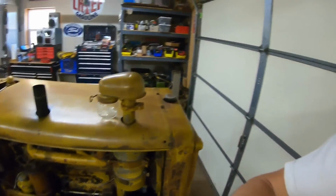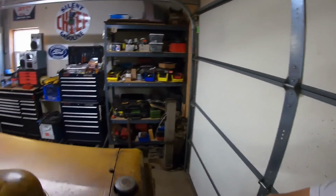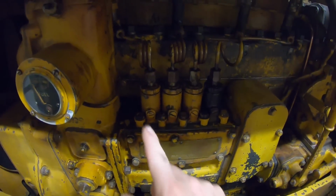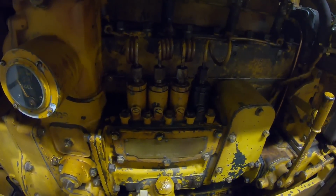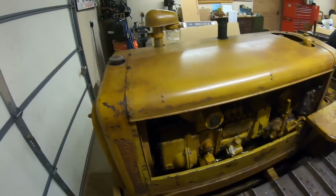We might start looking at cylinder number 1, maybe pull that injector out, pop test it. I might do all 4 while I'm at it. Another thing I never was able to test was the actual output of the 4 barrel pumps. If I have a barrel pump that's not putting as much fuel out as the others, or possibly too much, I'm leaning towards not enough, that could give me a funny pop noise accompanied with a miss. I don't know. That's where we are.